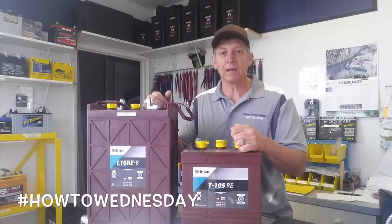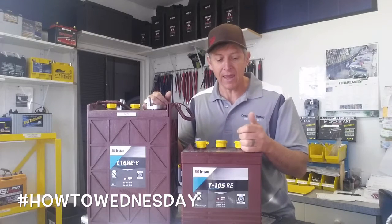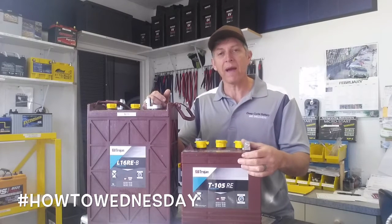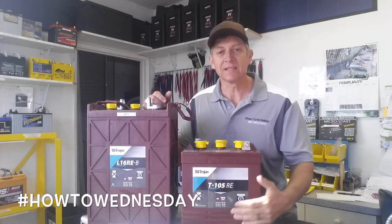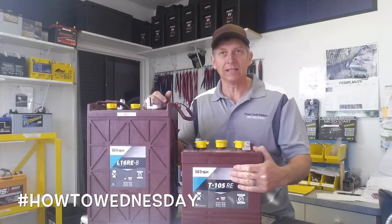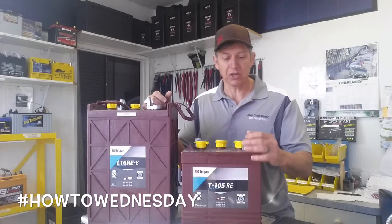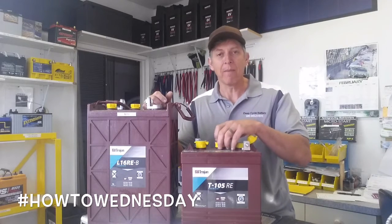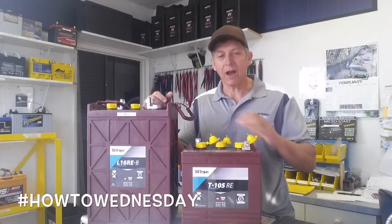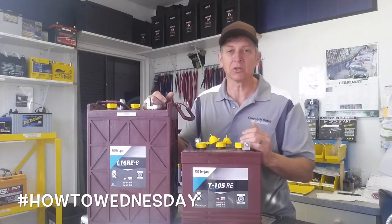They're expensive, and it makes a lot of sense. Let's unpack that. It does sound self-serving if we tell you that you have to replace all the batteries. The reason is: when batteries age, the internal resistance inside the battery starts to grow. Because of sulfation and lead sulfate, the batteries block the charging — they take longer and longer to charge. If you lift up a cap when the battery's not charged, you'll notice it goes from a cold state to a hot state and the water will start to boil. Over time, that charging and boiling gets longer and longer. We call this internal resistance.